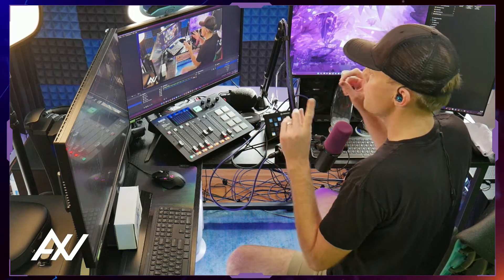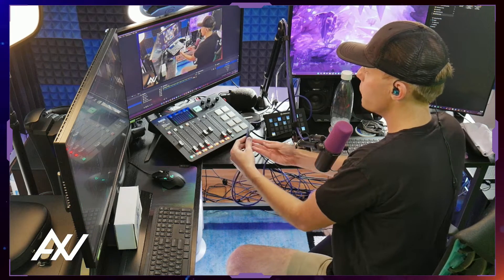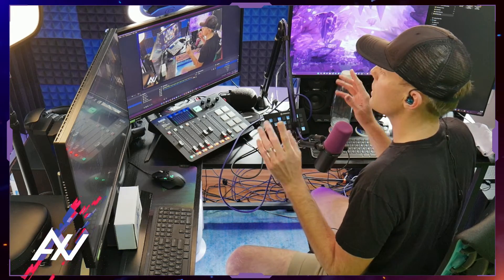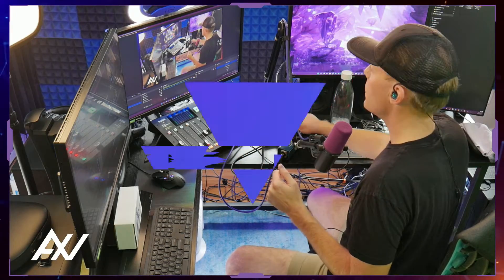Once everything is hooked up, there's one more step before you listen and record: ensure that all of your XLR cables — both coming from your microphone and going into your mixer — are not touching any power cables or lights. Power cables and lights will put line noise into your signal, like a constant hum in the background, and it will ruin your audio. I've done professional AV for 20 years — lights especially, if they touch audio cables, you'll hear that noise and wonder if your signal is grounded. Don't let these cables touch those cables.